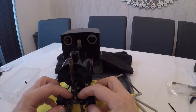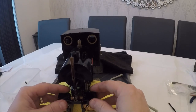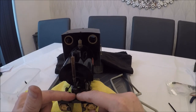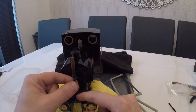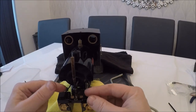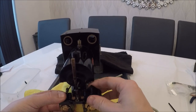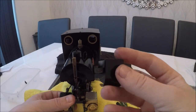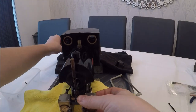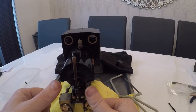We're at the point where I've slackened off the two nuts on the top that feed from the boiler. They've undone but they've bottomed out on the cylinders. Because the exhaust pipes are soldered together with the Summerlin's Chuffer, I can't separate the cylinders enough to clear the feed line. So I'm going to take off the cylinder covers — they literally just pop on and off — and then I'm going to cut the pipe just below the chuffer to separate the two cylinders.